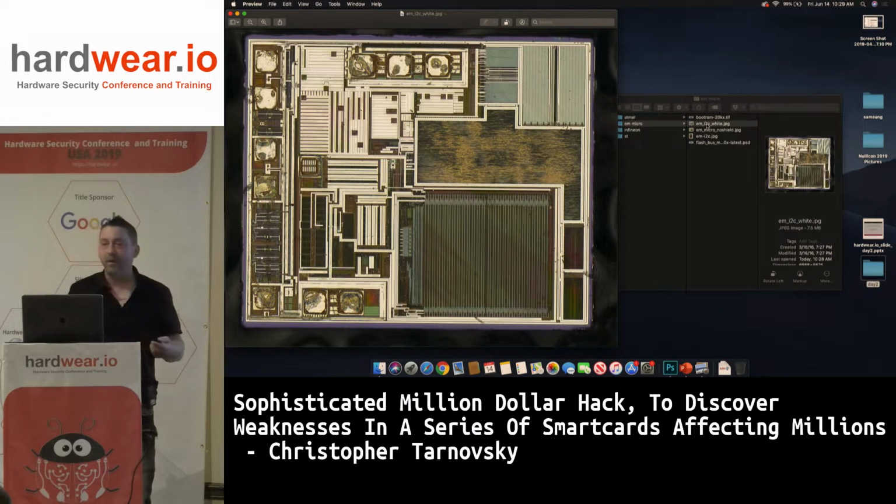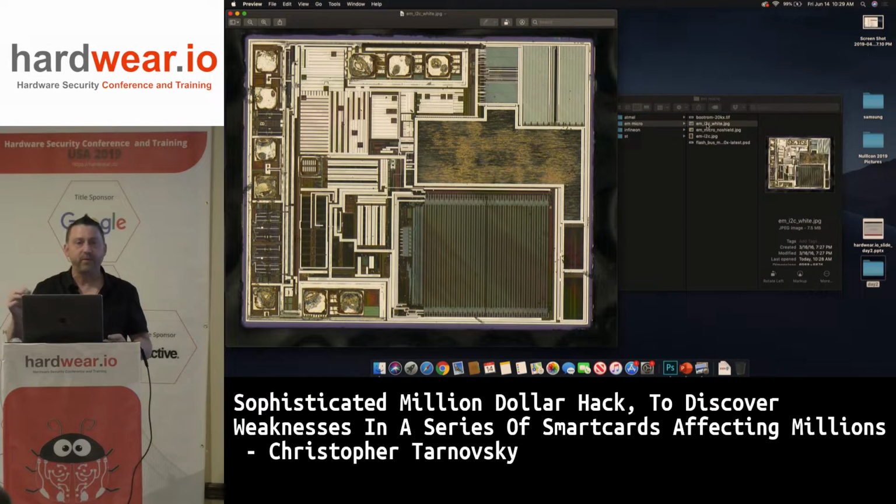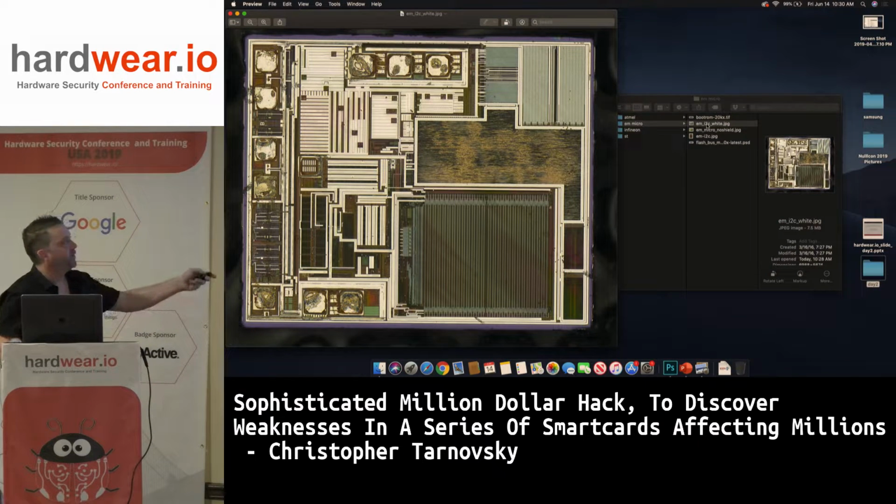So Chris and I just overwrote the OTP values with the dump from the encrypted chip and then read the chip back out, and it was in the clear. So we used their own crypto against them. You follow me? No? Kind of? Okay. To get the code out of this chip, you have to first understand the boot ROM.